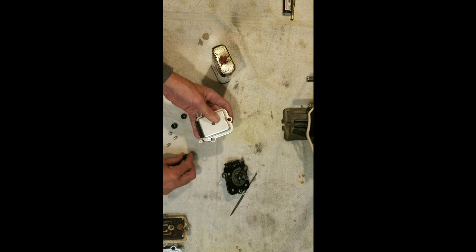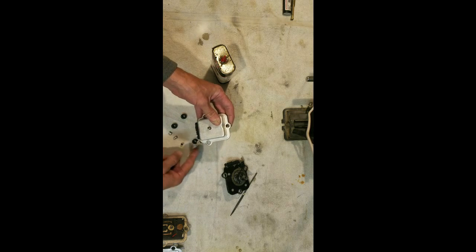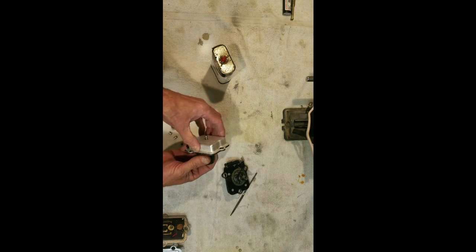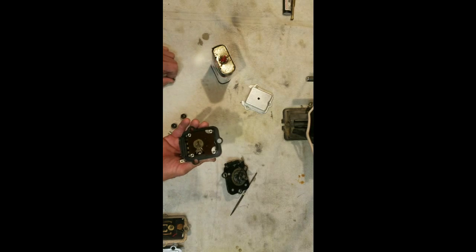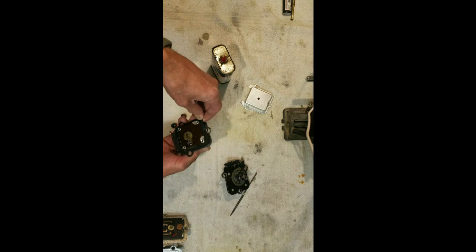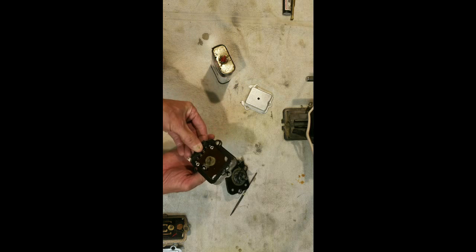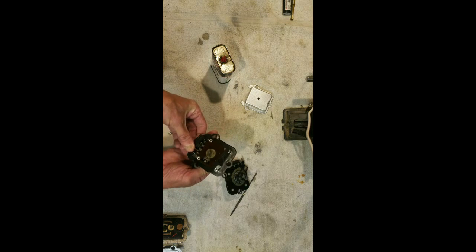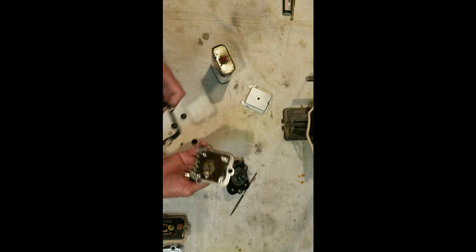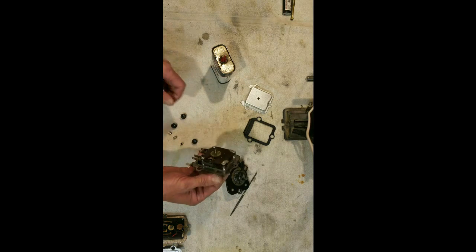I went ahead and pulled these grommets out, but before you pull the grommet there's actually a spacer in there. I removed those grommets and pushed them out. Now this easily slides off - I'm joking, before you have it CAD-plated and cleaned up they come off rough. This gasket here comes off and seals the entire unit. It's all stuck and formed on there, kind of a bitch to get off, but you can take it off.